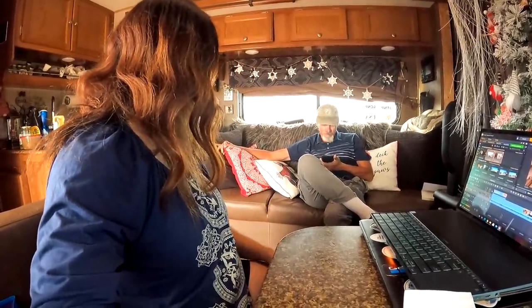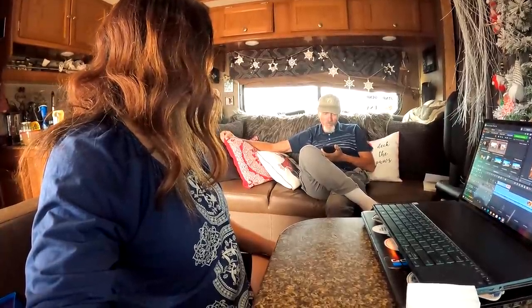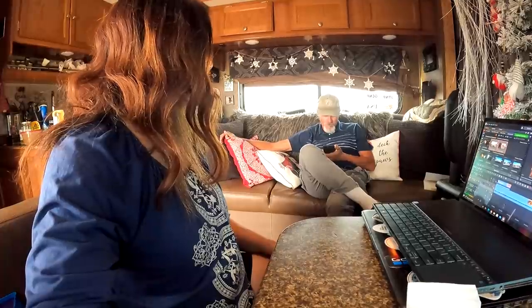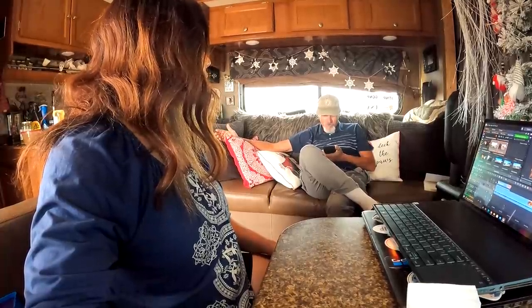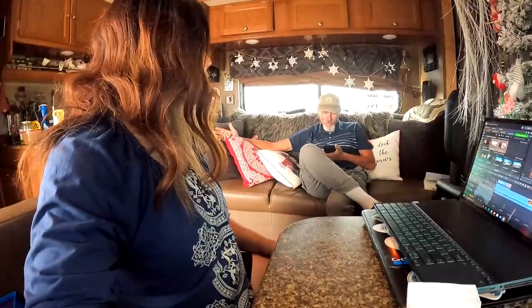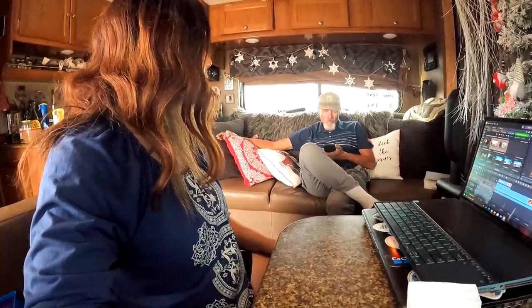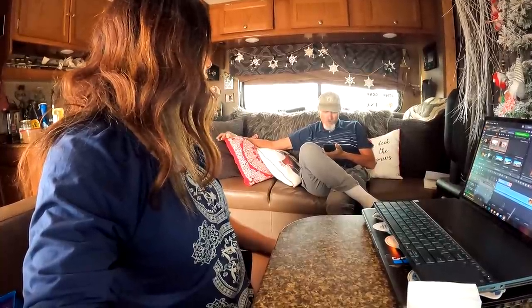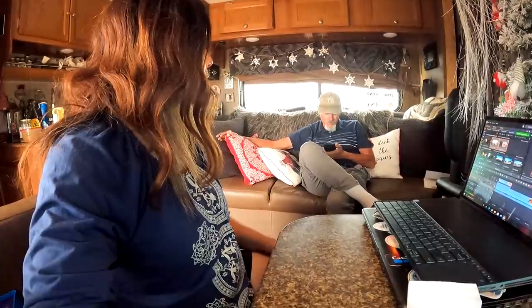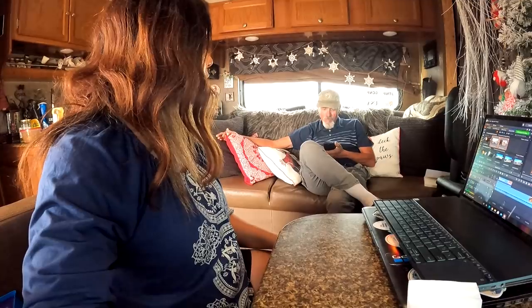You want to give some of the specs? Yeah. Someone on Amazon had answered that question: what's the charge time, what's the compatible solar panel? Their answer is that the suggested working voltage has to be greater than 20 volts. Open circuit voltage is less than 68 volts. The maximum output current is 500 watts. Right. And then they say charging time depends on the sunlight, duration of sunlight, etc. If you connect solar panels in parallel or series, we suggest using the same brand and model.